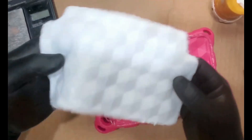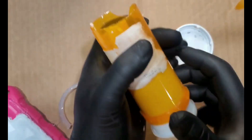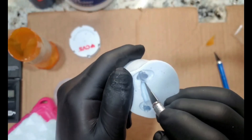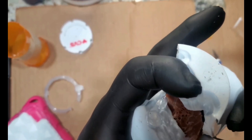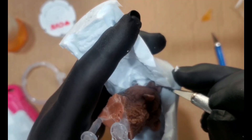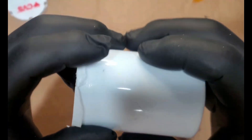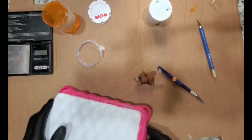Demolding Castamold 30 is also very easy. The pour-over molds came out perfect. Again, the push-and-pull method with the pillbox or pill container takes some time with a bigger piece, but it came out pretty easy. If you want to split it in half you can, then mend it so it holds the silicone when you pour. Again, using the cut-and-jagging method down the middle, trying to release strategically so that when you pour you don't miss any of those fine details you've worked so hard to retain with your silicone.